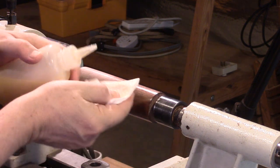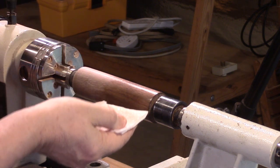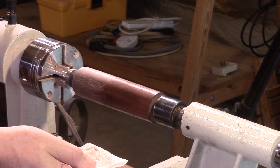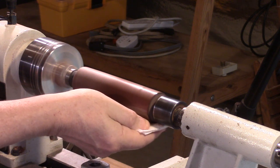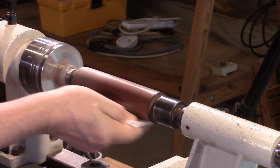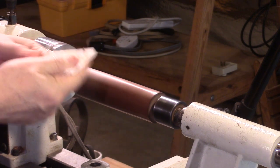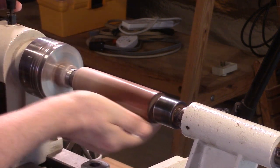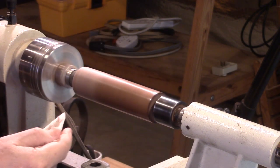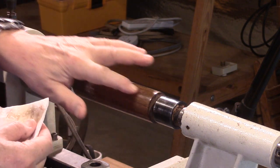Once it's on there, I put on some more polish — not much, just about that much. I stand back because it's going to spit up off the workpiece initially. I've got my lathe going at about 2,700 RPM. I just put on another layer of friction polish on top of what I just did. I'm actually putting a lot of pressure on here, enough to burn my hand or enough to be uncomfortable. But that's where the friction in friction polish comes from. So there we have it — this is one, or if you want to count it as two coats of friction polish.